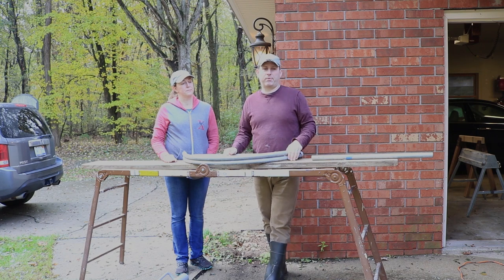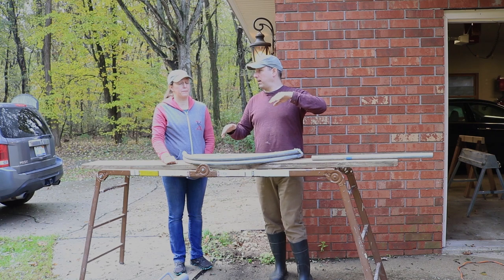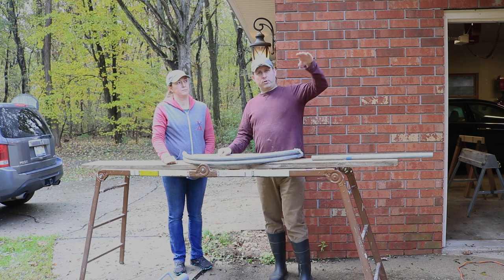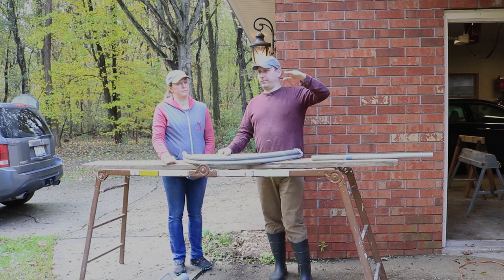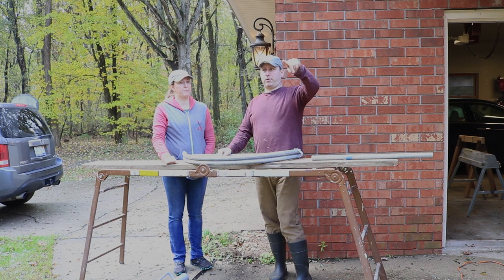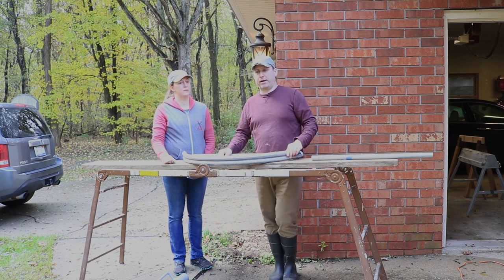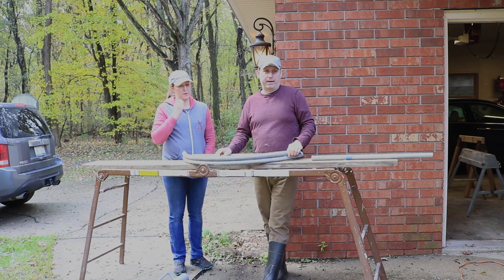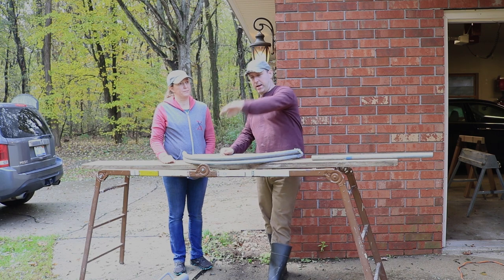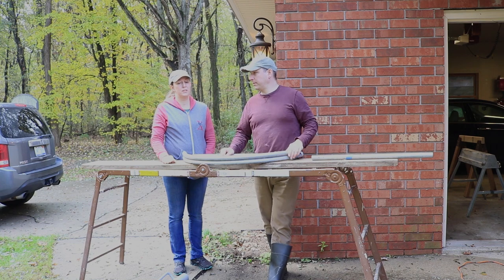We want to hold the plastic up, handle snow, and handle a little bit of wind as a semi-permanent structure. You have to make sure you don't get sags of water and snow in them — maybe we do our crossovers underneath so we get a consistent valley and things slide off. That's our big consideration with our arch: not only head space, but we can get a lot of snow. Snow will end up at the end, which blocks a little light but actually creates a buffer from losing too much heat.